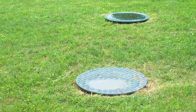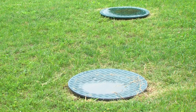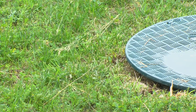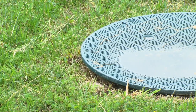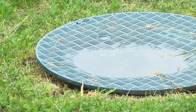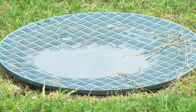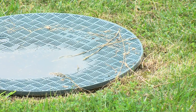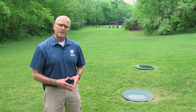You can see that we have tanks that have risers and lids to the surface. You always want to make sure that the lids are secured either with hardware, or if you have a concrete tank, you want to make sure that the concrete lid is intact and well maintained — that prevents unauthorized access to the tank, which is a very serious issue.